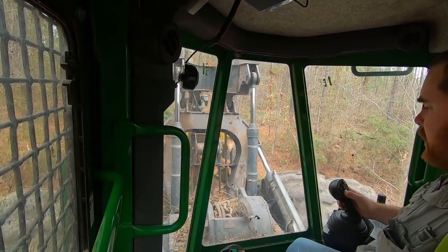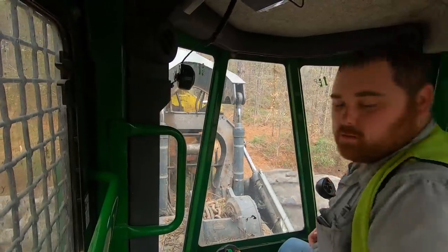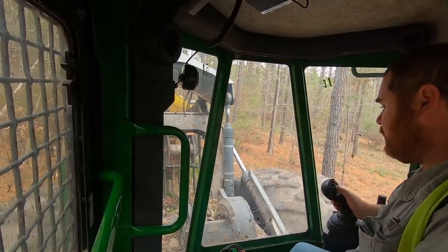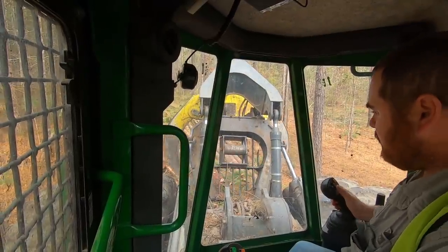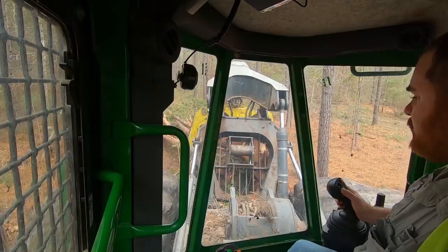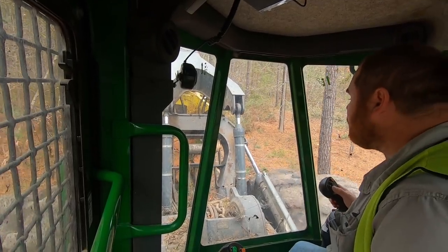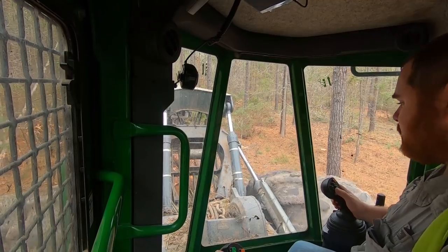I would like to see them put some kind of sensors on the steering for sure, and on the booms and the grapple. This is an L1, the L2s may have some of this already looked at. With these electronic controls, it's so hard to finesse sometimes. It's kind of like the Tigercat electric control stuff. It has a sensor, that's basically what it is, that reads how far the boom is moved. I think the technical term for it is a potentiometer.